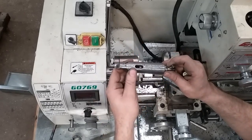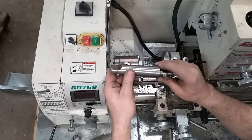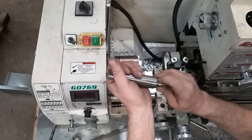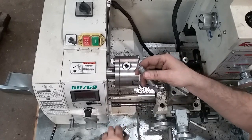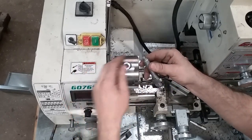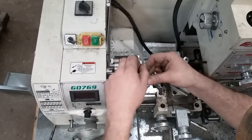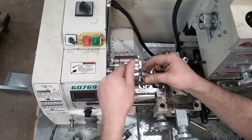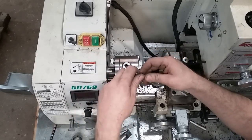Because my big drill press is primarily what I use to drive tapping with or do tapping operations with. And it's Morse taper 4. And so anyway, I need to make these. And remember in the last one we tapped the hole in the back of this for a drawbar in case we wanted to use it up here in this milling machine head, which it'll never get used in the milling machine. This milling machine won't drive something this big, or won't run a tap this big. It might run like a 10-32, but it won't run a 3/8 tap.